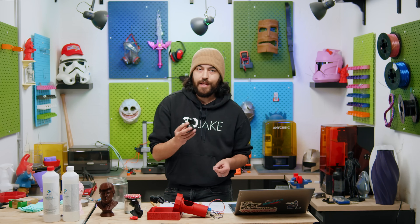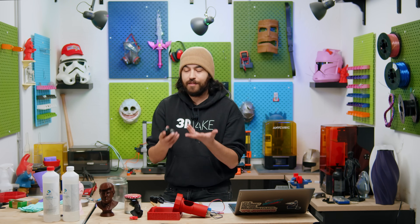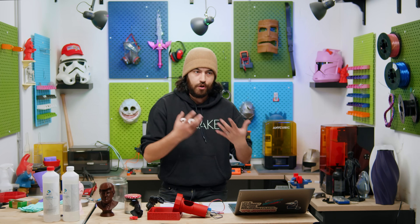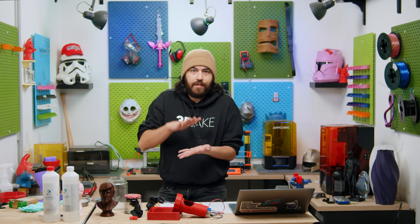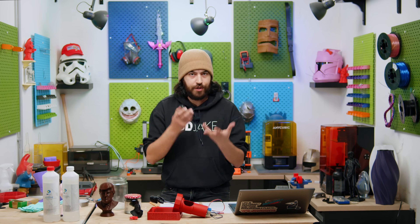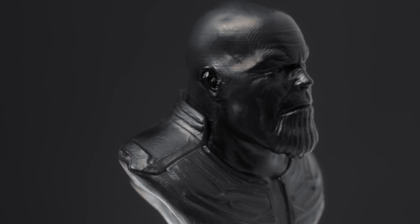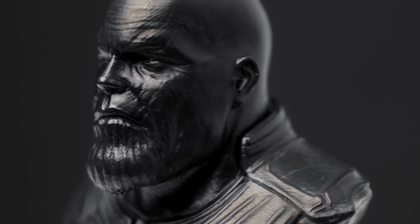I think this looks really awesome for miniatures and little busts. If you're printing something like a chess set, this is a really cool method to get it looking absolutely perfect. This isn't a quick way to make a crappy print look good — you can just avoid layer lines by using a very low layer height and something like our matte filament. But acetone smoothing will make your prints look very produced, as if they're injection molded or cast. It's a very specific look that you can't really achieve with other printing techniques — even resin printing doesn't really match this.